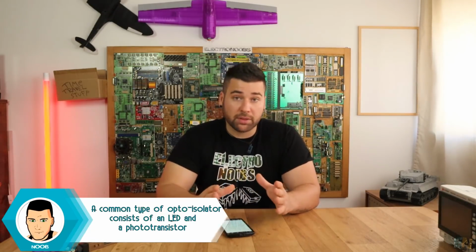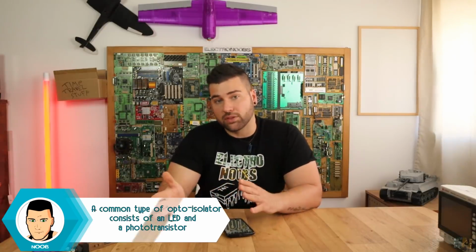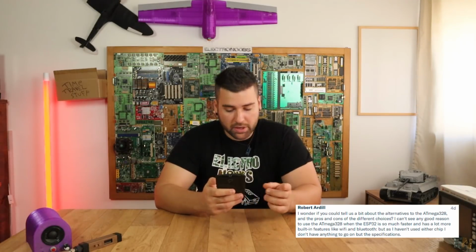but when you buy those on eBay you will get the entire module. So you will have the module with the relay, and then not a phototransistor but an optocoupler in order to separate the high voltage spikes that might occur from the rest of the circuit. So you might want to put an optocoupler between the Arduino and your coil. That will be great.